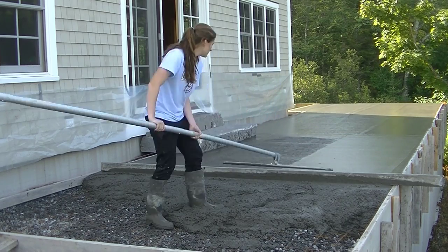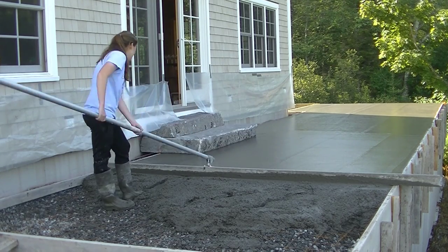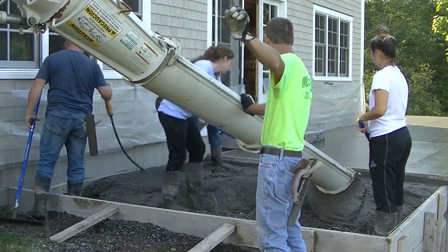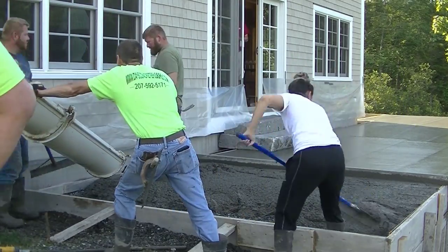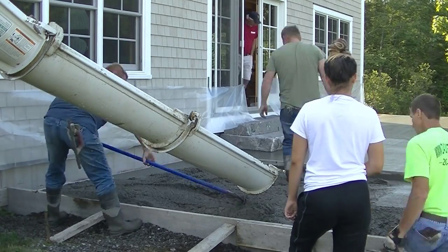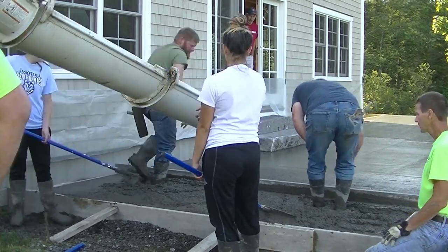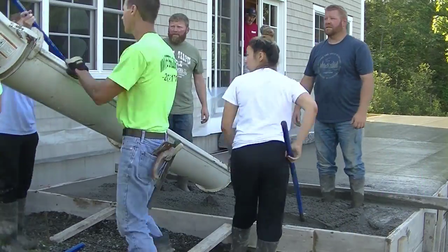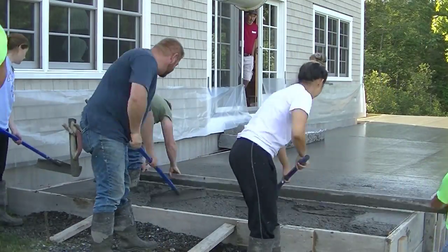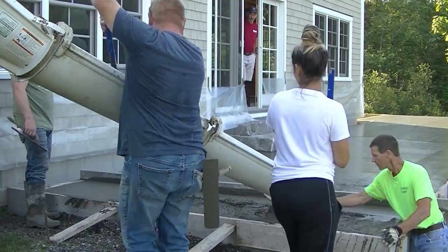Gold gray basically keeps the concrete a darker gray color. When concrete dries, especially this 4000 PSI mix, it actually dries really light — almost whitish, a really light gray. These people wanted to keep it a little darker, so that's why we put gray in. The pour went pretty good — it was about an 8-inch thick pour with wire mesh and fiber mesh for reinforcement. I always use 4000 PSI with a 3/8 p-stone mix for stamping projects because stamping the smaller aggregate is a little easier.